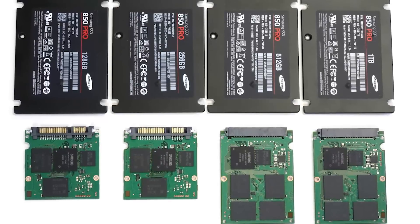So those SSDs that we've griped about had either 128 gigabit die, which was actually the worst offender — that works out to 16 gigabytes. So 16 gigabytes on one flash die means if you have only a 128 gigabyte SSD, that's not a whole lot of dies to distribute the writes among. Crucial tried to fix that with 64 gigabit dies, so you're doubling the count of dies inside that SSD, giving it more chips to address. The page size that you write is the same — it's just that there's less capacity and more parallel dies to do the writes.